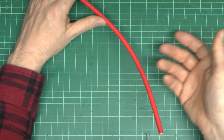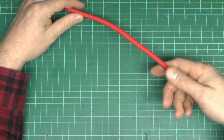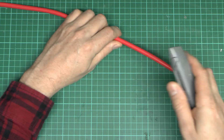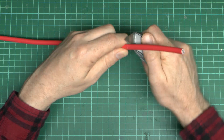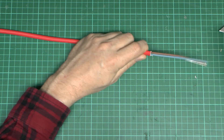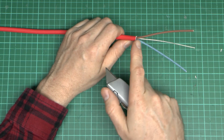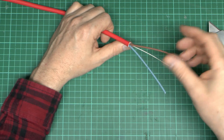This is a fairly rigid type of cable, and if it's bent into a shape, as you can see it stays in that particular shape very easily. So it's quite useful to actually install, because it can easily be formed and fixed to the wall in a nice tidy fashion. Now let's just cut the end off of this and see what we have inside. If we just score around the cable here, we can then just break it, and then the inner conductors can be revealed. It's important not to cut in too deeply — just score the outer, then it will tear through and break off nicely and cleanly.